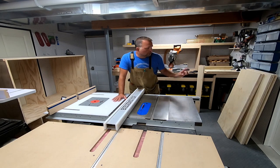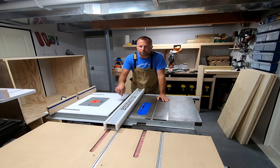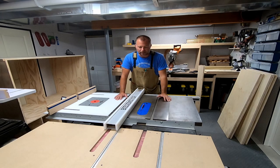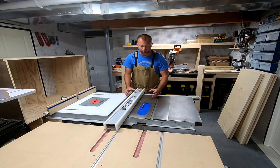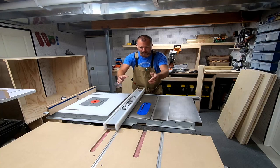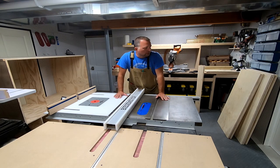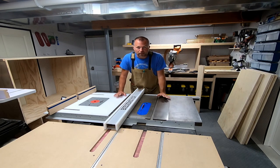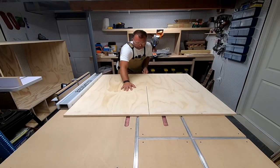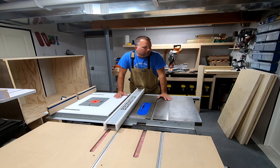I'm trying to make it as light as possible, so I'm going three-quarter-inch plywood and Kreg-jigging it all together with the pocket hole jig — that'll make it nice and strong, and I'll glue it too. The big difference with my design is cup holders. Some designs online have cup holders in the legs that fold down near the ground, but I have an idea: a separate set of legs that fold underneath and flip all the way around, coming up with cup holders in it. It's in my head — I think it'll work. We'll start by cutting the two-foot by four-foot regulation size boards, and we need to put a six-inch hole in there. If I don't have a six-inch hole saw, I'll use the router or jigsaw.